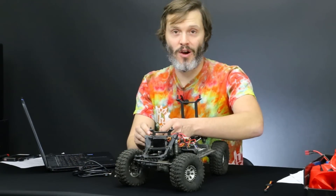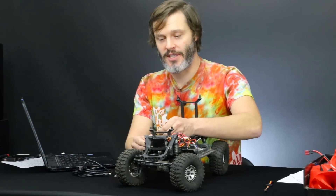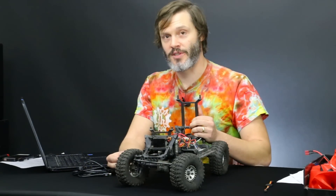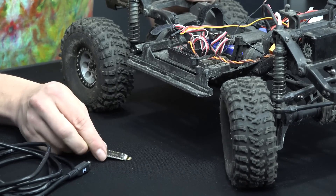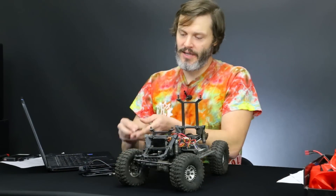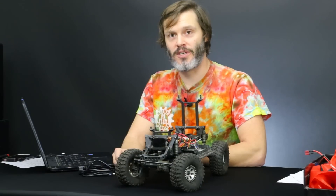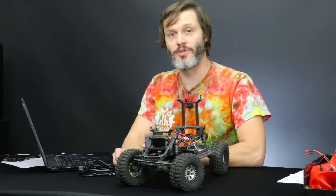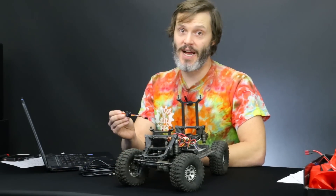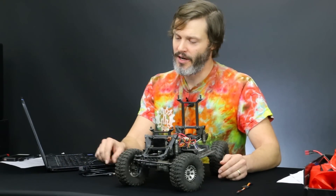Castle does have a little programming Y harness that you can buy so that you don't have to unplug it — I've never used one personally because it's really not too big of a deal. Hobbywing will actually have a separate wire for the ESC to program with, so you won't need to unplug it from your radio. The next thing we need is the programming chip from Castle, called the C-Link or Castle Link. We'll also need the USB cable to adapt it into the computer. They also have a Bluetooth adapter called the B-Link, which can actually be situated inside your rig so you don't have to get to it when programming, and it is fully functional with all the same features we'll see today.